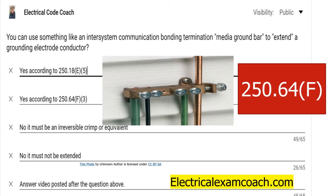What I mean by that is, let's say we were doing a ground rod to it, and we also brought the waterline ground to it as well. One of them is only required to be a number six, but that waterline ground would actually be required to be a number four. So you can have a number four from the waterline to this termination, a number six from the ground rod to this termination, but the wire that physically goes to the service enclosure has to be based off the largest of the two. In this case, it would have to be a full-size number four heading to the service enclosure.